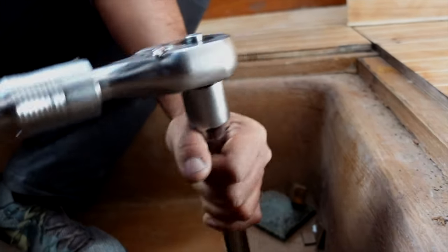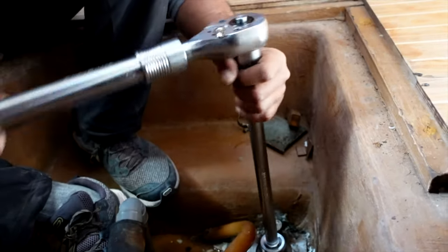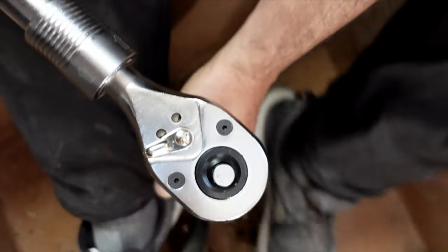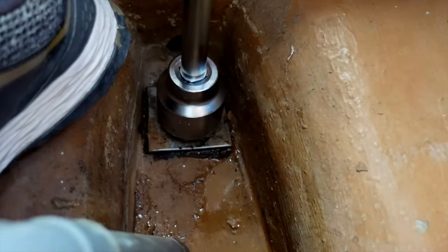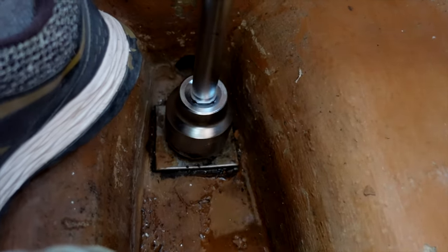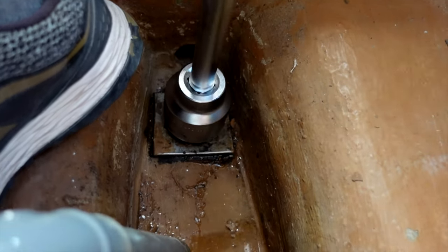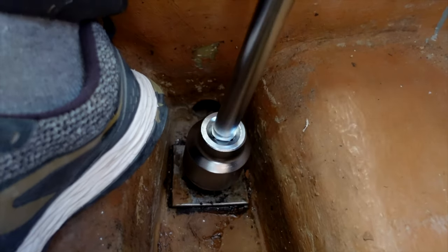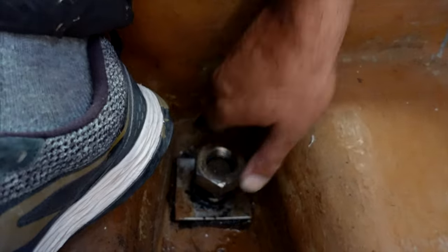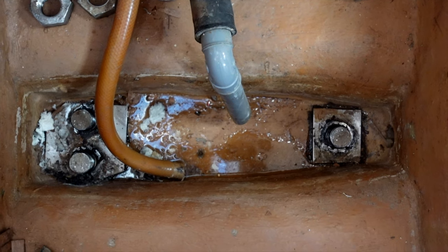The Sika glued between the bottom of the hull and the top of the keel is old. We suppose it will come off easily, but we can't be sure. The nuts and stainless steel plates on the top of the bolts in the bilge have been set up since probably the first time the keel was tied to the boat when she was built. When we got the boat, we had a quick look. These nuts looked to be in very good condition. There was no apparent corrosion. But you never know until you try and unscrew them for good.